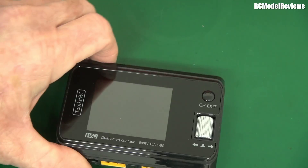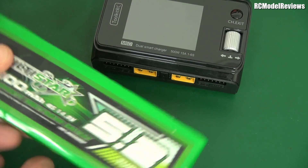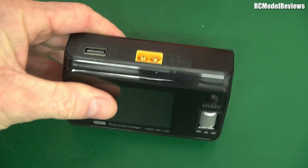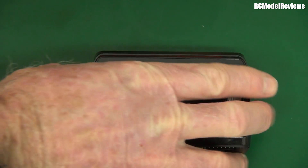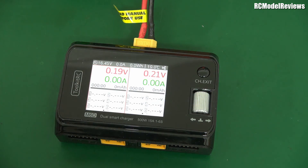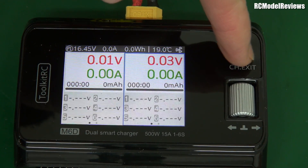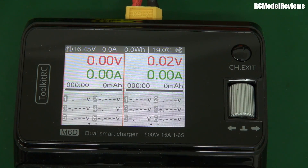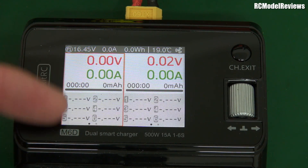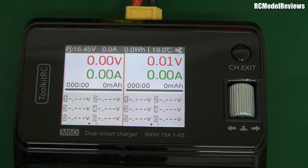Now, this will change everything. For the purposes of this test, I'm going to power this from my 4S 5200 milliamp battery pack. It'll take anything up to 30-something volts — I'll link to the spec sheet in the description. So this simply plugs in the back, and you can hear it's got a fan. Let's take a closer look at the screen. As you can see, it is dual channel. We've got two channels — this little button here changes the active channel. At the moment it's not got any voltage, no current — nothing on the cell voltages. It's telling us we've got 16.45 volts in with no current draw, from our 4-cell battery pack.